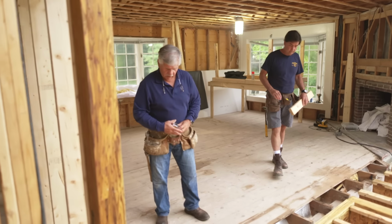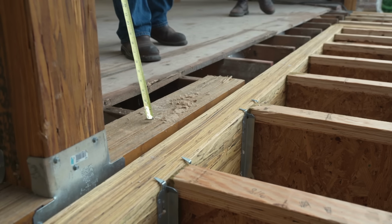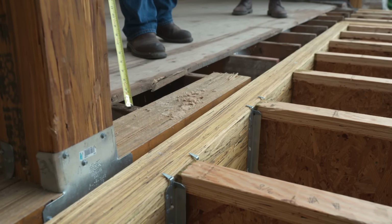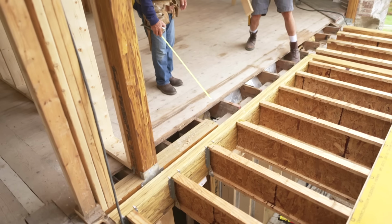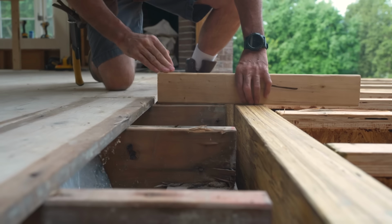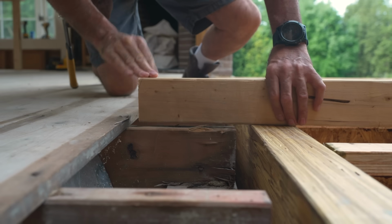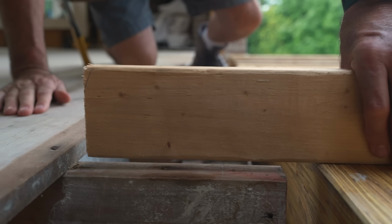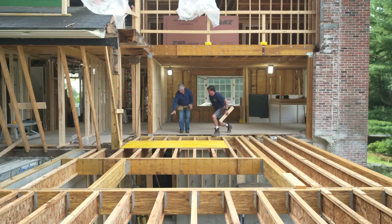Let's check it right here, Charlie. So they installed this new beam with the post down below. They made this flush with the new addition, and that brought this joist up also. And around the center here is probably our low point. Quarter. Yeah, it progressively gets worse. Yep, 3/8. There's 1/2 inch to 5/8 right there. So this was down right here almost 3/4, if I can remember.